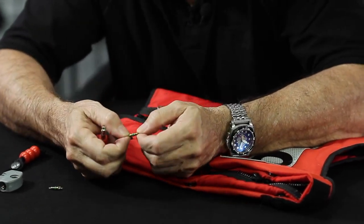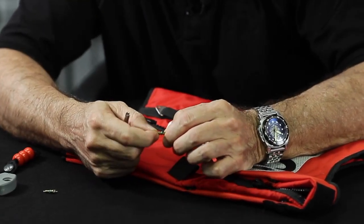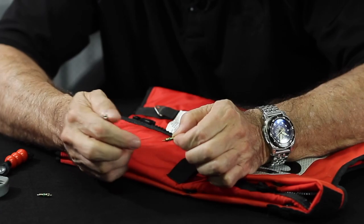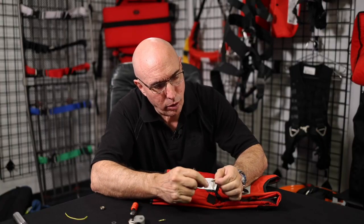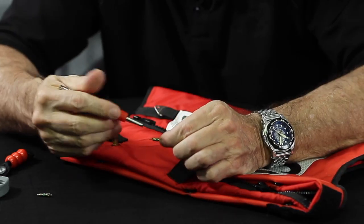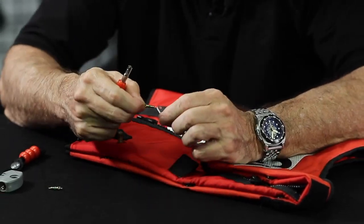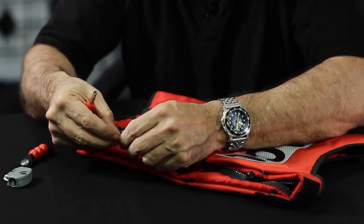And I can look and see that this gasket is just train wrecked from being over pressured. Might not have leaked. It didn't cut it, but it's really squashed up right there on the ends. That gasket also keeps the air from leaving the bladder, so it can leak right there. That's one of the primary places that bladders leak, is from around that Schrader valve. So we'll go ahead and put this new fresh one in.